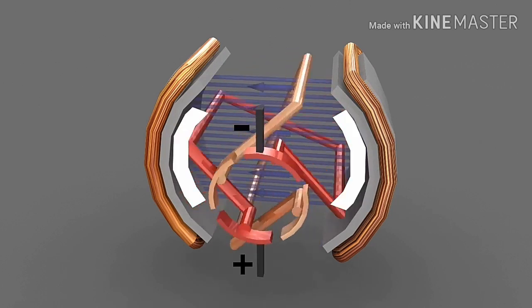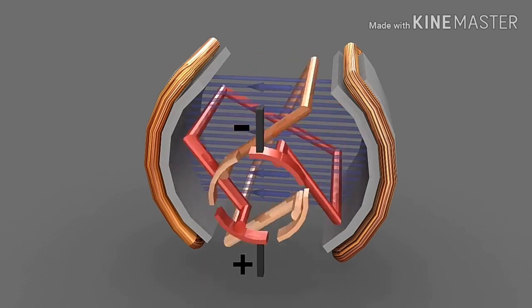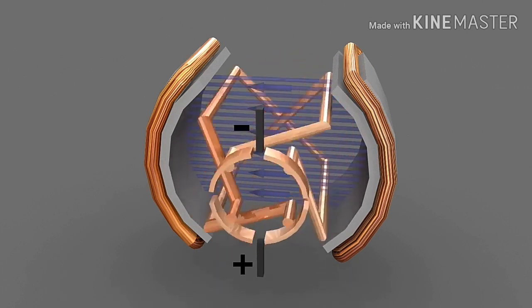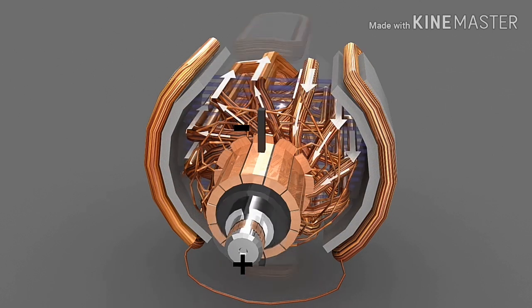When one coil passes through the region of maximum torque, the next coil will take its place. This way, the shaft of the rotor always provides higher and smoother torque. Coils are connected to the commutator segment in such a way that at every instant of time, each and every coil carries current. The sides of the coil that come to the left-hand side carry current in one direction, and the sides at the right-hand side carry current in the opposite direction, irrespective of the rotor position. This can be achieved by the lap or wave connection of windings.